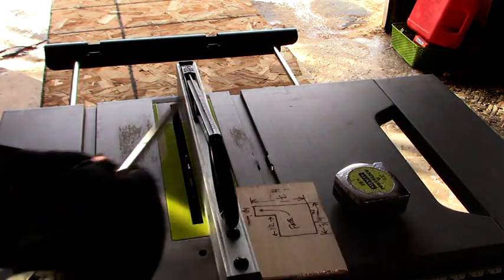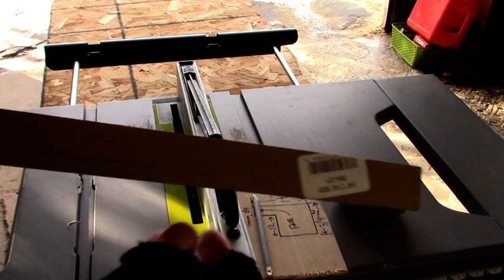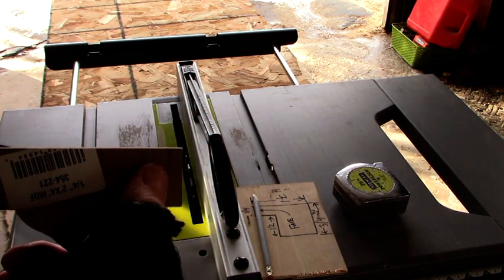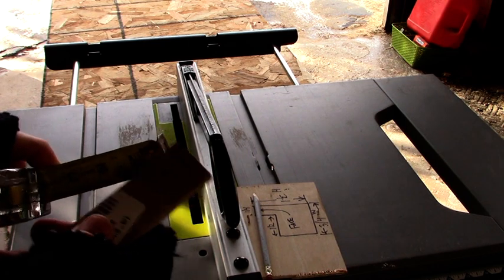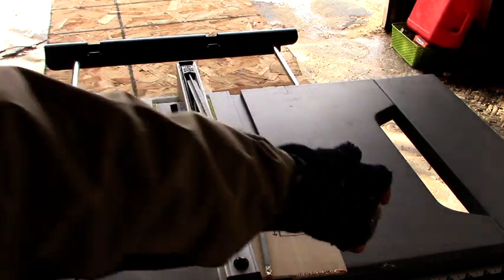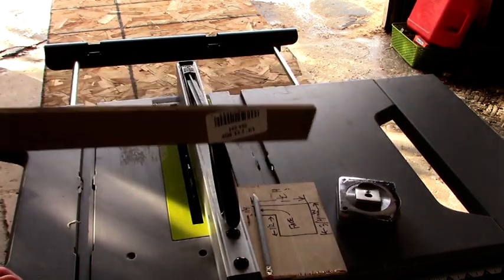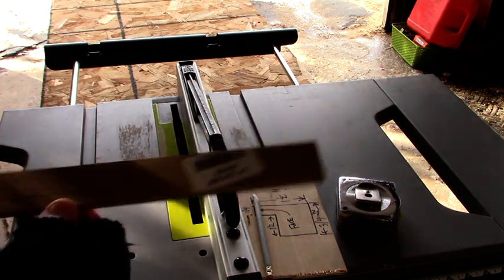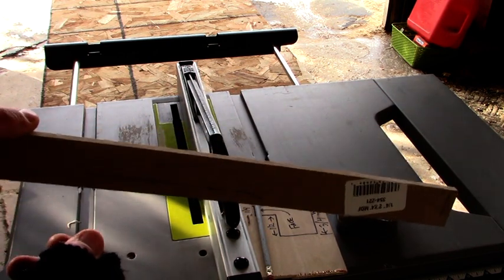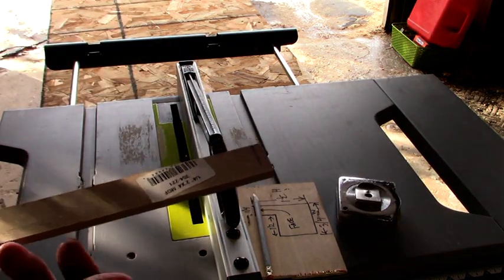I've just taken this board that I created the saw height with and drew a line for the 1/4 inch mark. You can use your tape measure, but because of that little tab on the end can be sometimes distracting. So if you do this a lot, you will have this as your jig, sort of a piece of wood, and have it in your studio, in your garage, in a place that's convenient with your saw. And then you have a quick setup stick. And you can have different settings here for different depths. I mean, you'll make up your own device, but let me show you.